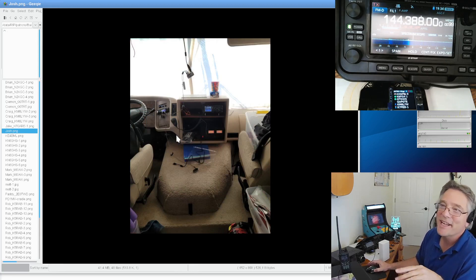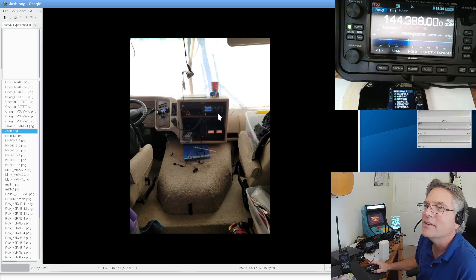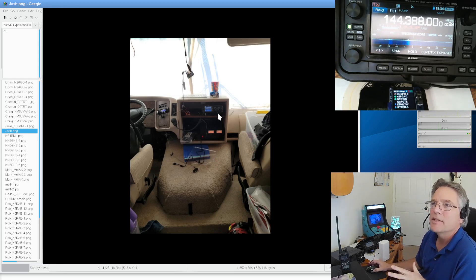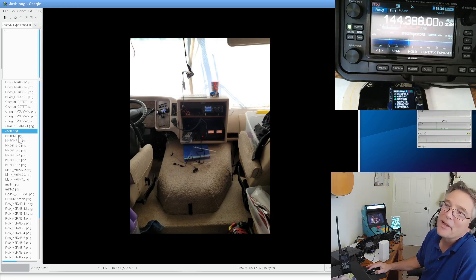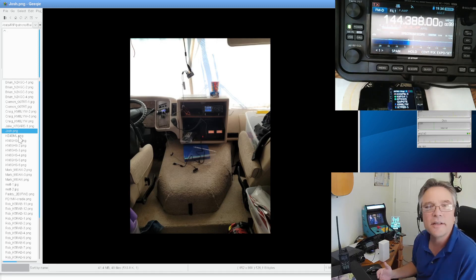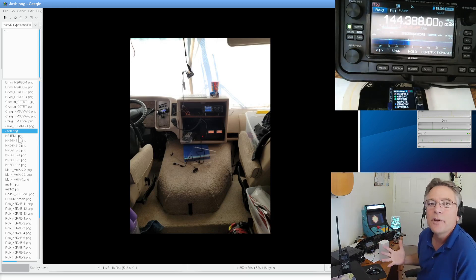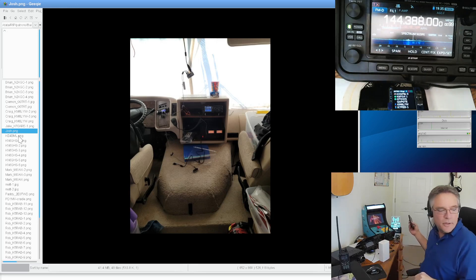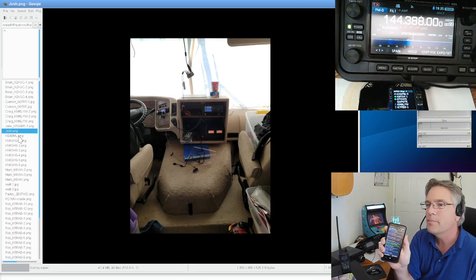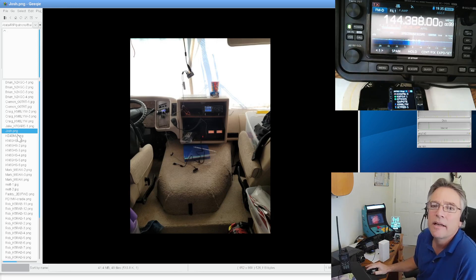Then there's Josh — I like this shot because it's obviously his RV, with the DigiPi hanging in the window dangling down into what looks like a Yaesu 991. This is probably a Class A DigiPi — just the Pi itself, a USB cable, and the DigiPi software image. That's all you need to implement every digital mode on your amateur radio. A $1,000 radio does voice and RTTY; add a DigiPi and you get every digital mode using your phone. Good work, Josh.